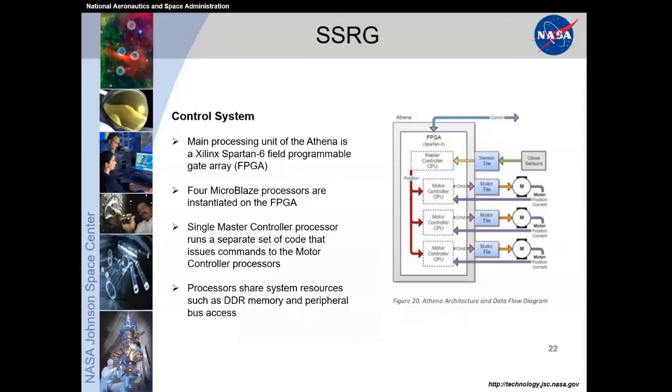But it's all correlating those glove sensor positions to the motor positions, avoiding the positive feedback control of motors moving. Doesn't that eventually cause your finger to move? A lot of balance there within that position control to make sure that the glove was measuring your user's intent to move as opposed to creating the intent to move itself. All that goes into the control system. Next slide.